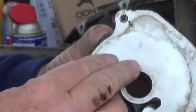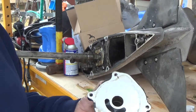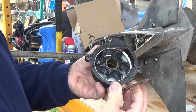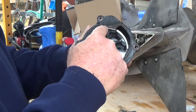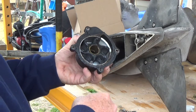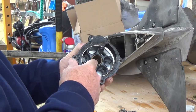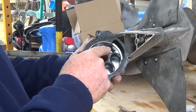On this here, let me see if I can get you in there. You've got to make sure that you put that impeller back in the same way this one was. See how these vanes turn one way? That's the way we need the vanes on the new one, so when we have to crimp it to put it in there, we want to make sure that they're not facing the wrong direction — we want to make sure they're facing this direction.